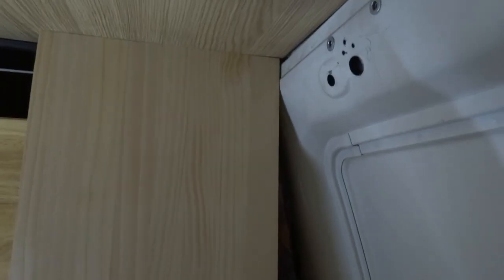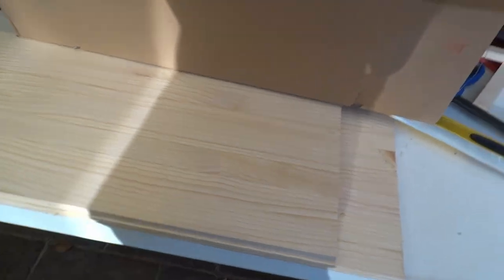So using my contour gauge, I've marked out the first line there. Now the problem is that it doesn't need to move in that much. It needs to move into the furthest point here. So essentially, I need to keep marking and cutting until the closest point is touching the wall. So I figured, easier than making lots of little cuts on the big piece of wood, it's gonna be a lot better to have one stencil that I can just make one solid detailed cut on my piece with.